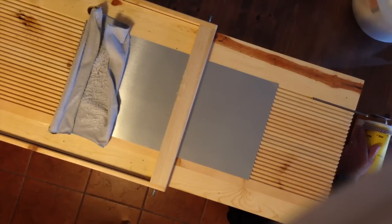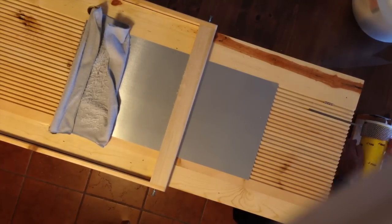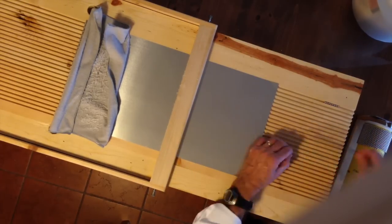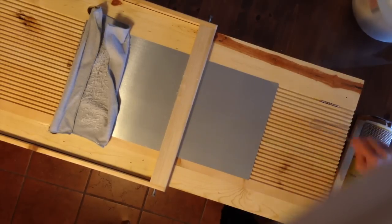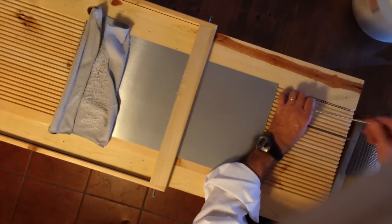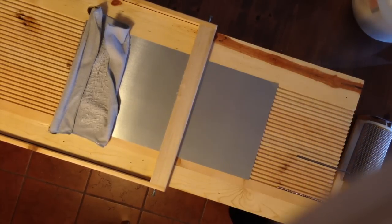Since this procedure does not clean the right side of the rightmost magnet on each chain, I remove these 25 rightmost magnets from the chains and add them to the next batch of magnets to be cleaned. Thus, the procedure fully cleans 25 magnets short of 2,500 magnets, for a total of 2,475 magnets. The watch reads just over 35 minutes.